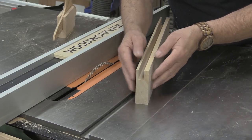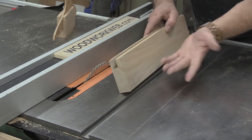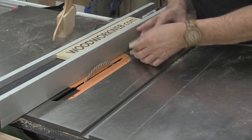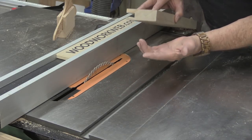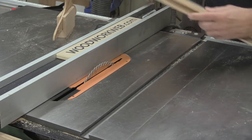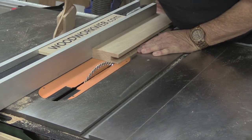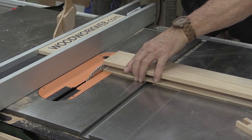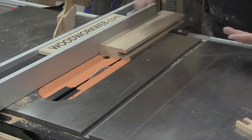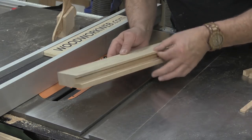Here's a situation where we start big and work smaller and smaller. The next thing is to cut the little lip off the side, and typically the easiest way is to measure it and do it this way. But the problem is you're going to get kickback — this little piece is going to kick back, and that's okay as long as you know it's coming back at you. You can plan for it, but you can also do it another way: put it open like this and reset by hand, eyeballing it, and drop the blade down a little — now when that comes off it's just going to fall off the side.